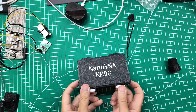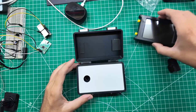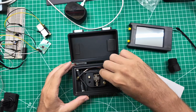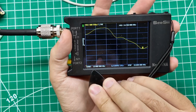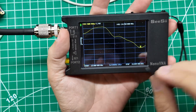To start off with, I'm going to need my Nano VNA — this is the H4 model in its 3D printed case — along with some adapters. I'm going to do the calibration off camera because you guys have already seen that. I calibrated from 12 megahertz to 15 megahertz with 101 points.